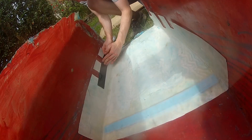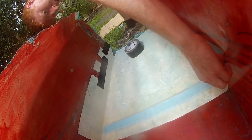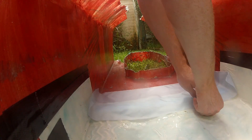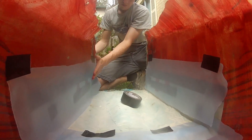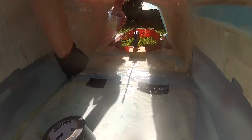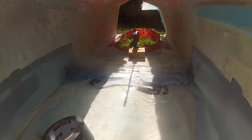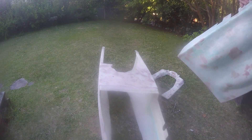Making the lips in the bodywork pieces was done in a couple of different ways. The shock shroud where it met the main body was the easiest to do. I placed it into the mold and taped it down so that the flanges sat flush with the mold surface. I then placed peel ply over all of the flanges to prevent the parts from becoming glued to one another when I laid down the new fiberglass. The fiberglass was done next — it bonded to the main bodywork, which was cut such that the edges matched exactly with the shock shroud edges. Another layer of peel ply went down next, allowing me to place weight over the fiberglass without it bonding. This resulted in flanges that would ideally match perfectly with the attaching part. The quality of the finished product was mixed, but where it worked, it worked well.